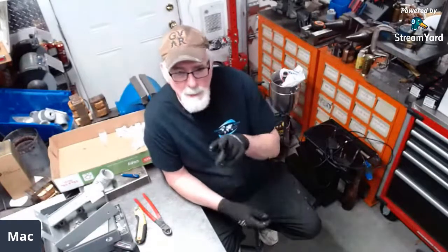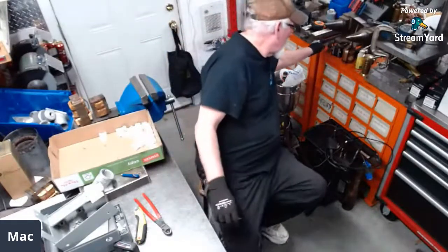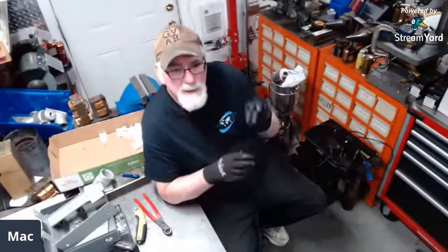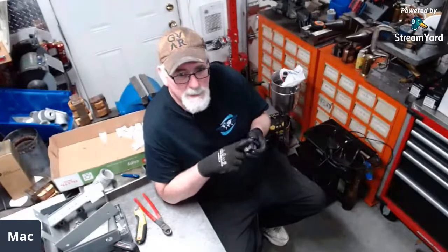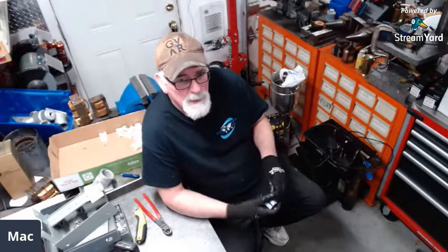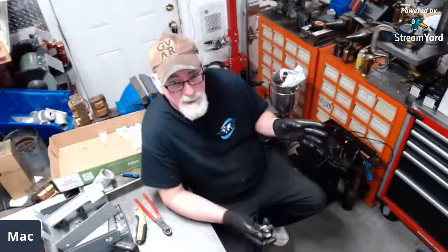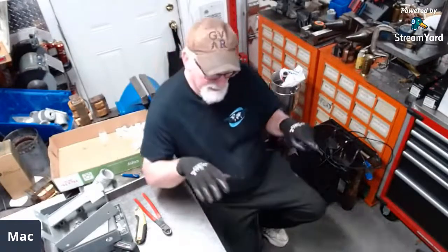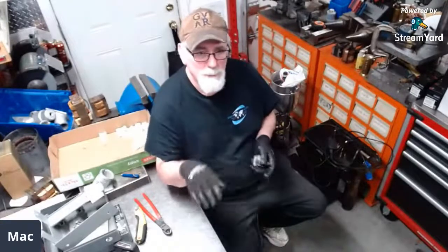Well, that's the unanswered question, J-Reel. What am I going to grind with it? Take something like this, these real smooth edges. I have to use a surface grinder to get that super smooth edge on it. If I get the forge built, I can always make some knives and grind the knives with it. A lot of knife makers use them. It's got a magnetic table, so you just lay the knife on there and run it across both sides to true up the blade.